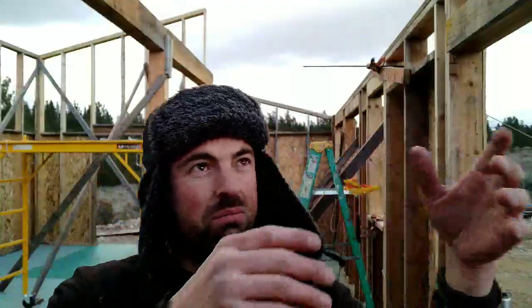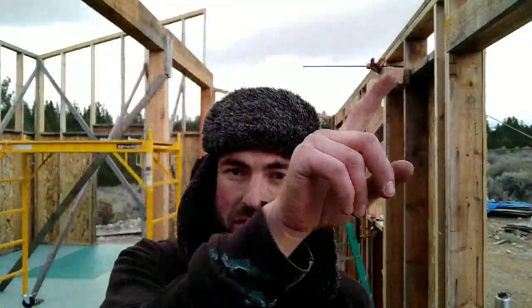And this is all going to help me when I go to put the rafters on, so they should match up with where the top plate is. After I get that done, I'm going to measure from the beam to the rafter at the different locations here, and then I'm going to cut. I'm going to bird's mouth those rafters so that they can sit on top of this double top plate. I probably only stream for another hour or so. Actually, definitely won't cut them today, but I'll get some measurements in and stuff.